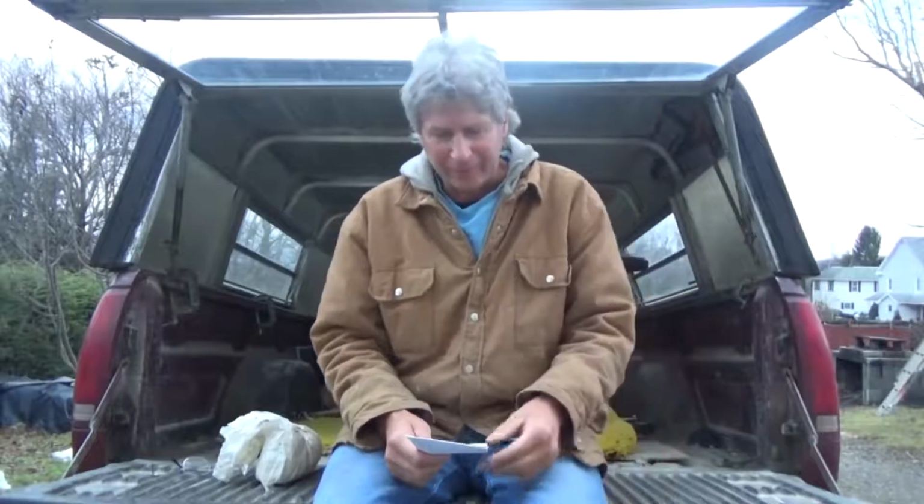You see me make that Portland paint up. That's old school whitewashing. You gotta wet it real good first. Wet the wall real good, paint that Portland on and then put the mortar right over the top of it. Never had a problem. Never had a callback. Whether you call it plastering or painting, all they wanted was to fix that wall up so it wouldn't leak behind the roof.